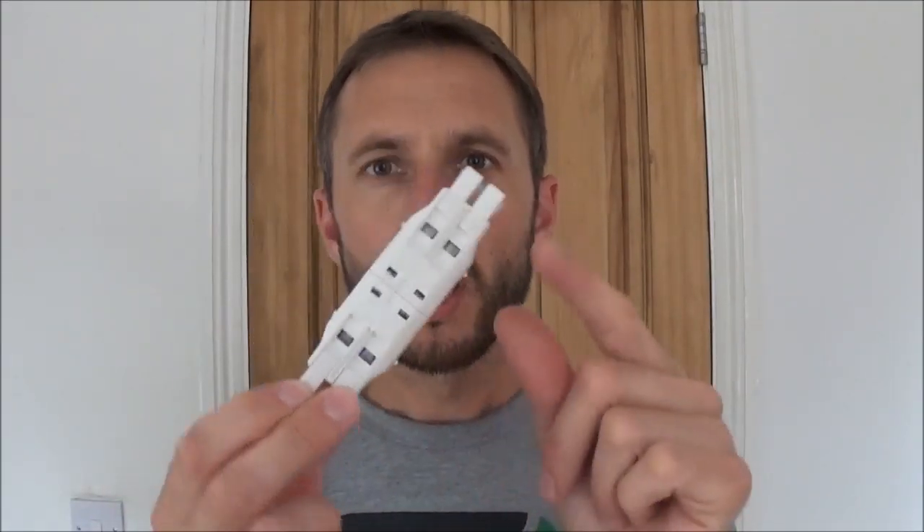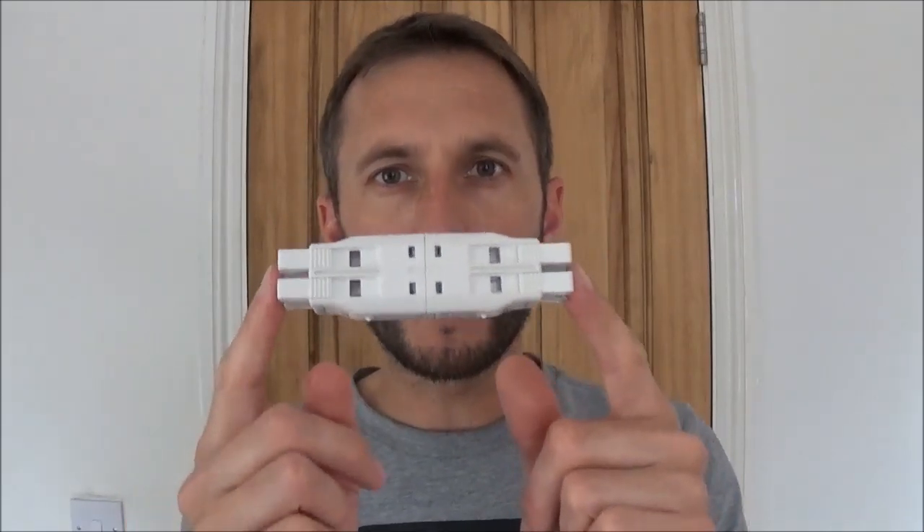Both these products are designed for use in domestic lighting circuits and they're rated at 250 volts and 16 amps. They can be used with 1mm or 1.5mm twin and earth cable. They can only be used with solid core cable, so they can't be used with flexible or braided cable or wires. They're really nice and small, so they can be pushed up through really small holes in the ceiling, like when you're doing mini down lighters.